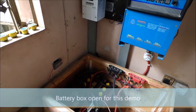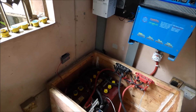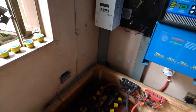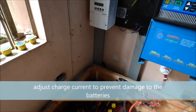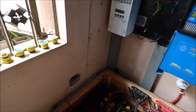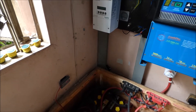Your sophisticated inverters and sophisticated charge controllers come with a battery temperature sensor. What they do is take the temperature of your battery bank and adjust the charge current coming in. If the battery is too warm, they reduce the charge current to prevent overheating. If batteries are cool enough, they can send maximum current. I'm going to demonstrate how this works.